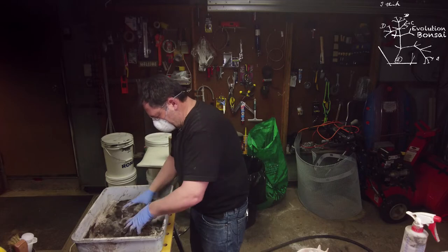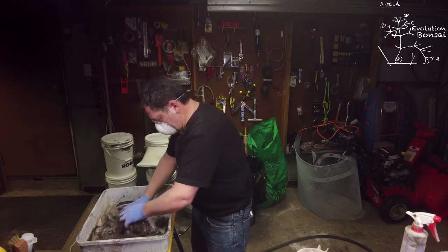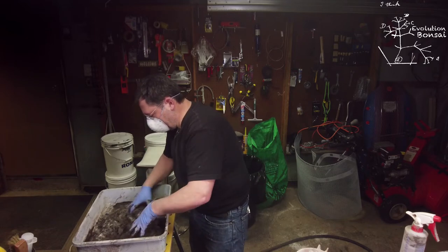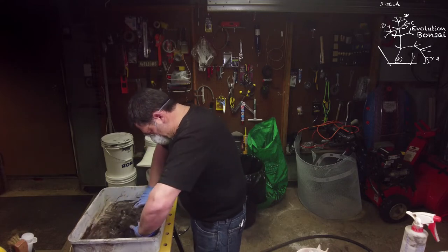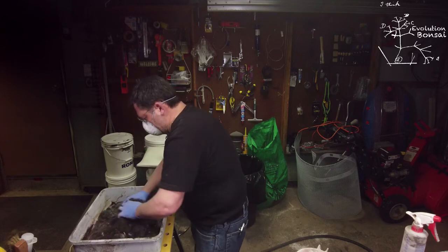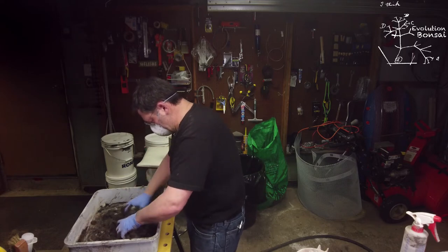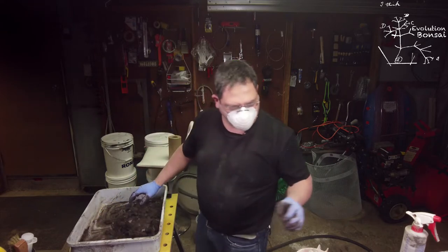As you can see, this doesn't look at all like cement. It's like a chocolate chip cookie dough, if you ever made that. But really, you only need as much water as necessary to hydrate all the cement. What will turn this into a mixture that is workable is the superplasticizer. However, at this moment that we already mixed water, the time is ticking. So now there is no turning back.